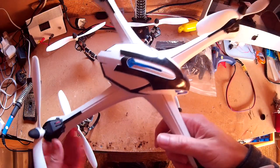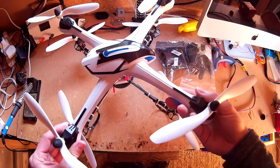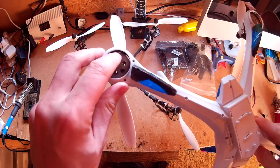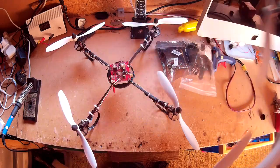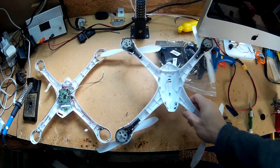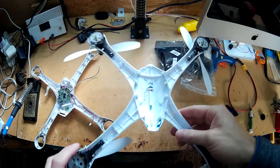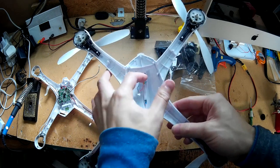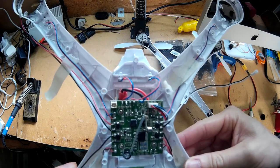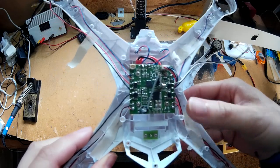What I'm going to do is take the flight control board out of the X6 Tarantula. This is the same size and only weighs 200 grams, so there shouldn't be too much difference. This one isn't working at the moment because I need to get a new main gear - I've shredded it. So I'm going to take the flight control out and try it on there. Here's a look inside the X6 Tarantula - that's the top half with the four motors in. Just unplug the plugs from the motors, and there's a small plug for the LED light in the top. Then there's the control board. I'm just going to unsolder this and solder it onto the other DIY quad.